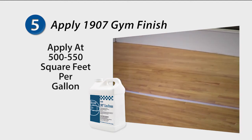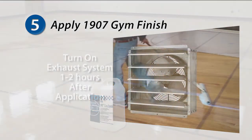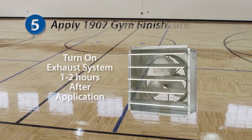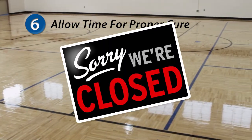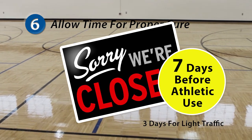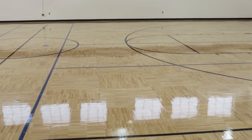1907 should be applied at a rate of 500 to 550 square feet per gallon. Turn on the exhaust system 1 to 2 hours after application. Step 6. Allow 1907 gym finish to cure before opening up to traffic. Your floor is looking great and ready for play. Congratulations on a job well done.